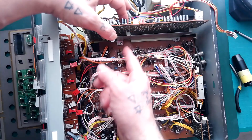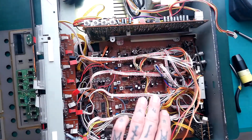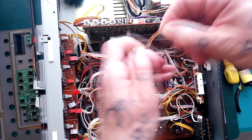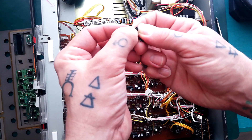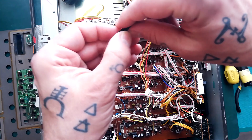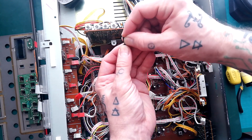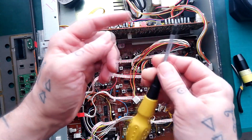We could look at removing this bracket. There are two plastic clips that via this bracket are keeping this relay and oscillator board upright. The way they work: there's a little plastic pin — if you push that out, you can pull them from the far side. This pushes through this part, and when you put it back, those four little bits that splay out are pushed in together so it'll pass through the hole. When the pin goes in, it widens them out so they're too wide to get through the hole and it's trapped. On reassembly, roll them with your fingers so the splayed bit is closed, push it through the hole, then from the same side push through the pin. To open it in the first place, I'm just pushing the center with something sharpish like the point of a screwdriver.